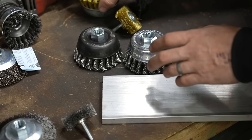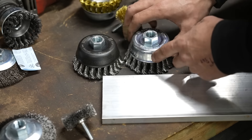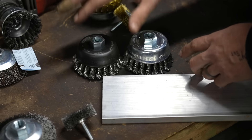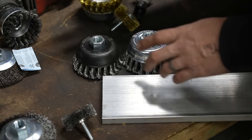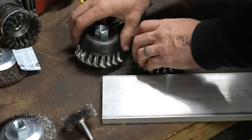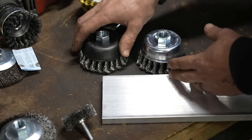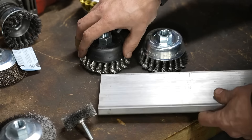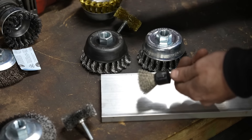So that's super important. On these, it's pretty clearly labeled — this one says stainless steel and this one says carbon steel. But if you're ever not sure, look for a CS or SS on your grinding wheel or wire wheel consumable: CS is carbon steel and SS is stainless steel. Really important so that you don't wind up ruining something.